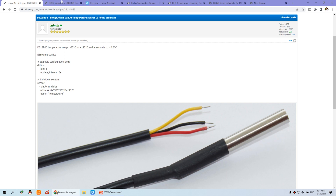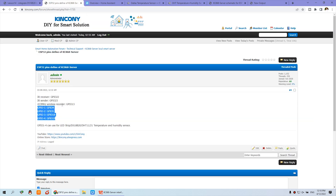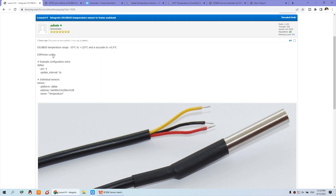In the ESPHome configuration, GPIO channel 1 corresponds to GPIO 4 — this is the first channel. You can also see the ESP32 pin definitions: GPIO channels 1, 2, 3, 4 map to GPIO pins 4, 5, 18, and 19. That is how every channel is defined for this server board. Now we can go to ESPHome.